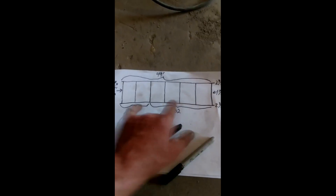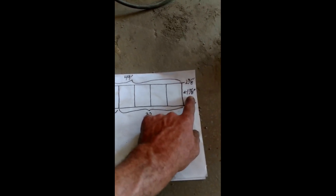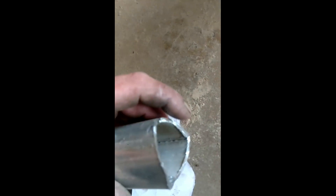Here's a picture I drew of the 32-foot cantilever gate — 32 feet of chain link and 17 feet of backstop for 49 feet total. I'm cutting these pipes out of one and seven-eighths tube. Shout out to metalgeek.com — you can get a template that prints out as a PDF. You enter the cut tube, the parent tube, the wall thickness, and the degree angle, and it prints out a PDF template. You trace it, lay it across the pipe, find the welded seam on the inside, and wrap the template around, then use an angle grinder to cut out the V.